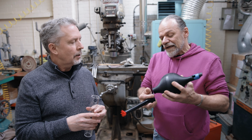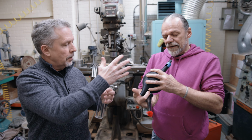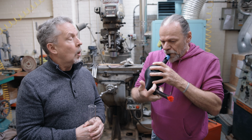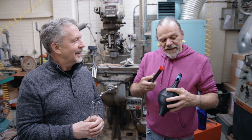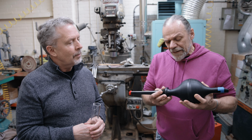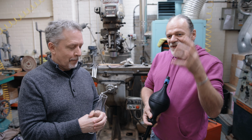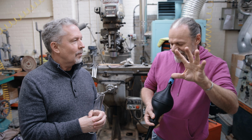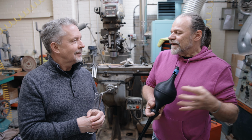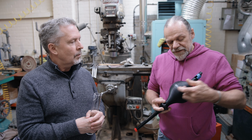I'll block the end here, and that represents just a simple sealed chamber, like a cabinet. So I'll just blow gently into this. Oh, you could hear it. But exactly. So there's the fundamental, which you hear, but as you blow a little harder, you can hear the overtones. If I now put this absorber in... Well, that's the fundamental. You want that fundamental resonance, but the overtones... Gone. So you can hear they've gone. So again, the exponential absorber has completely got rid of those end-to-end resonances.